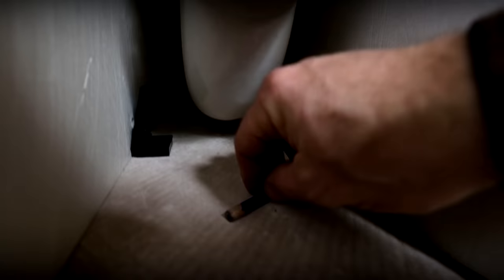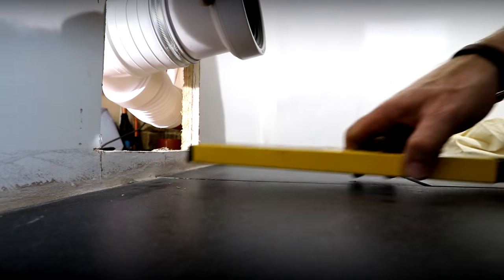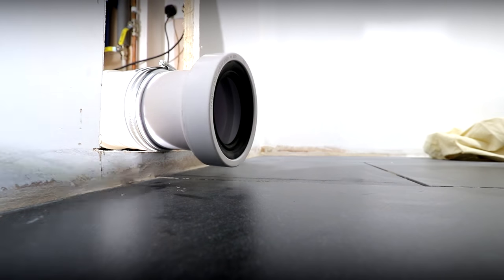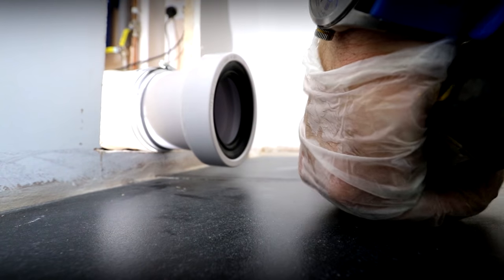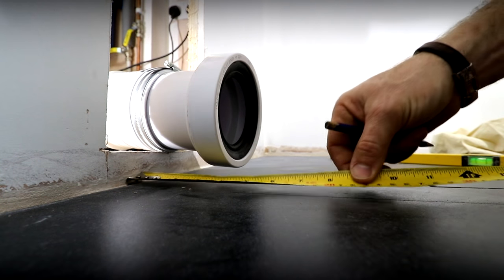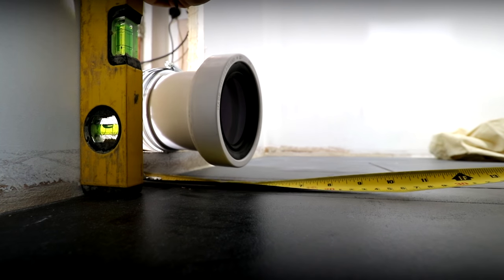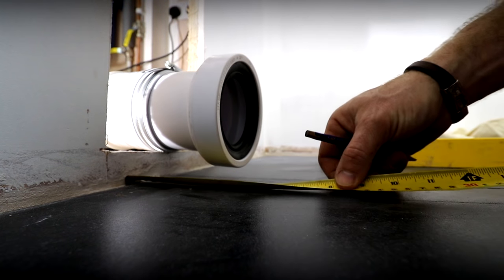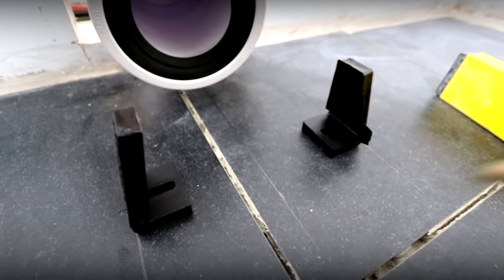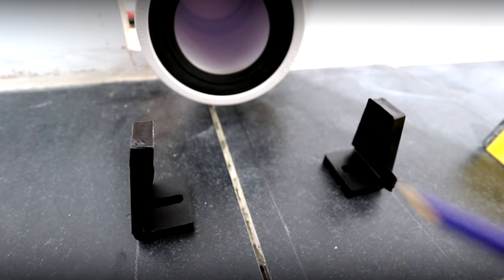If you've got Big Fat John or whatever comes and sits on the toilet and it moves, Big Fat John ain't going to be very happy. So we're going to measure this distance here — we've got another mark as well just here. Hoping everything's nice and square, we can draw a centre line out here at 581mm. We know how far out to go because we've measured our distances, so we know we're going to come out nine centimetres that way and nine centimetres that way. What we need to do then is measure the depth of the holes coming off the back of this wall. Make sure your wall isn't out of level — bang a bubble on there and make sure that wall's reasonably level, as you can see it is. So now we know these are in the right place — we've got a centre line, our width line, and then we measured out from the wall to get the line across. Now we can mark our holes, drill, and plug these two down.